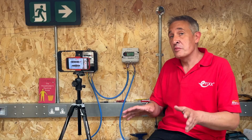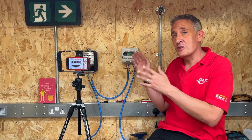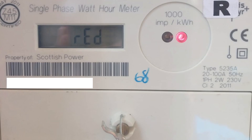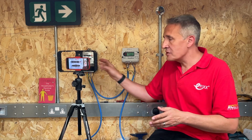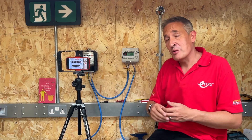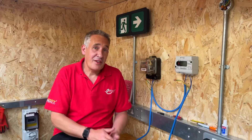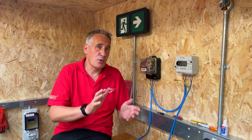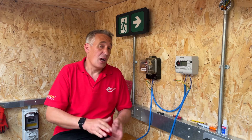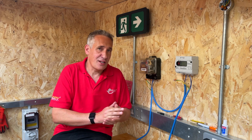A few more discoveries about meters we found out making this video. Older style non-smart meters that are digital will show RED in the display for reverse energy direction, and obviously won't subtract the numbers off the digital display. And certain types of analog meter won't run backwards — they have a backstop to stop this scenario from happening. If you've had solar panels fitted, your installer should advise you that your meter is not fit for purpose and won't record export power, at which stage it's up to you to take the initiative with your energy supplier and get that corrected.